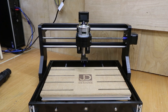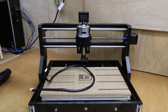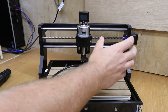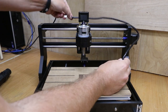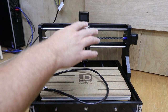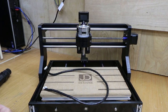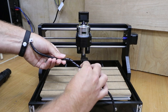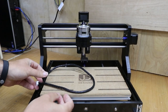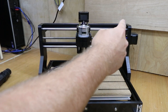The second accessory I got is cable protectors. On the X and Y axis motors this is less relevant because they're static, however on your Z axis and the power supply for the spindle the cables are constantly moving back and forth, which runs the risk of wires rubbing on the gantry. You want to give protection to these cables because otherwise they will eventually wear down or get caught on something and potentially ruin a job or even damage parts on the machine. It's a simple plastic spiral that you can pick up from Amazon or eBay quite cheaply. If you want something more complex, there are fully 3D printed systems with a roller track that winds back and forth as the machine moves.